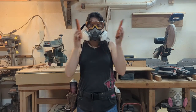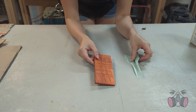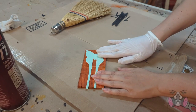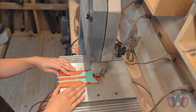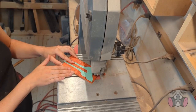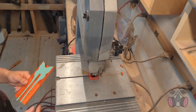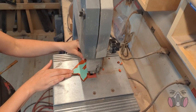But I survived! In the end I had these two pieces. I only needed the thinner one, so we'll save the other for later. Now I can take this little stencil I drew out and use that as a guide. I sprayed it with adhesive and made sure to get the glue all over my hands. After I had it placed how I wanted, I went onto my smaller bandsaw to cut the general shape. This blade is pretty thin, but it's still too thick to handle the super curved parts, so the first thing I do in these scenarios is cut notches around all the curves — the pieces just break off and I can cut through somewhat seamlessly. Doing this made me want to buy a scroll saw. I don't need it, but I want it. I'm giving myself five projects where I have to make these cuts using the bandsaw before I convince myself I need the purchase — so this is one. Four more projects to go and mama gets a new toy.